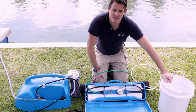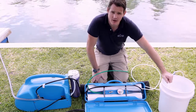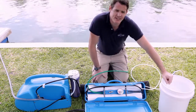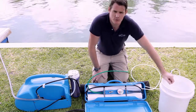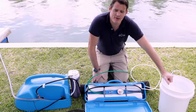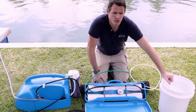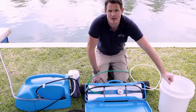Pickling the system is an extremely easy process. Before you turn the system off and shut it down, you're going to take your product water and start to fill a five-gallon bucket — you want to get this about half full with your product water. It's very important that you only use your product water for this procedure. You don't want to use tap water or any city or dock water, as that water may contain chlorine or other contaminants. Chlorine will damage and destroy your membranes.